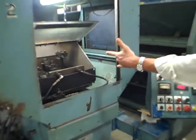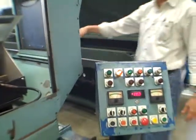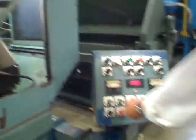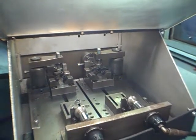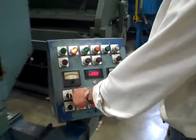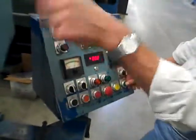I'm going to do the same thing all over again with this one. I'm going to clamp up first, bring the door down, go into the auto cycle. I've got a pretty good shot on the right hand side here. Manual first, let me clamp up — it's dual palms. Got no parts in there but it's happy. Coolant starts. Flip over to auto and cycle start, come around here and we should get it right here. Door will go down and start up.